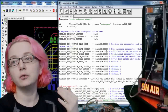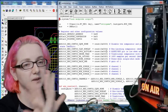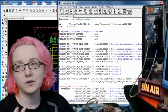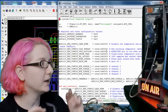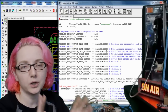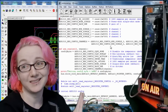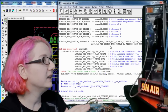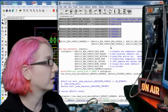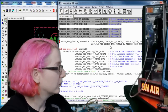While I could have used a Python library that does every kind of conversion with gains and samples per second options, I wanted to make this script as simple as possible, so I made it like a micro driver. I basically took the core elements of the driver so that all it does is read values from the channels and give you back the 16-bit value, and that's it. It's not extensible, but it does one thing. I think it was a worthwhile trade-off to not have to import multiple different libraries, and worry about what if something changes in that library, I didn't want it to affect this.